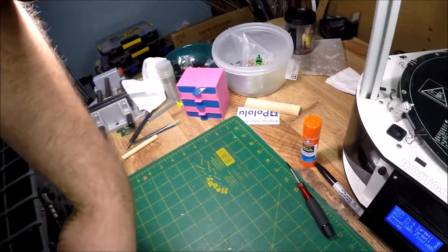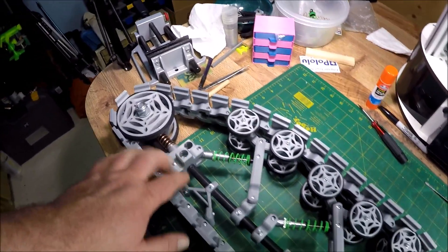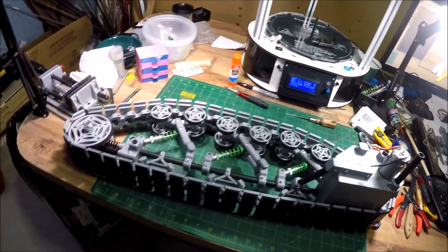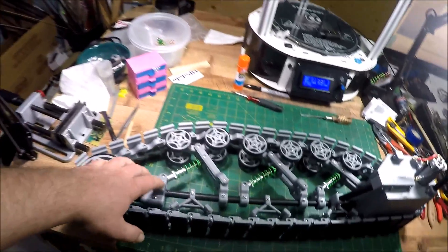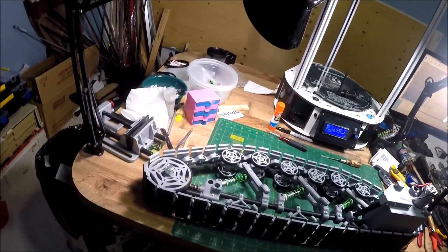A couple of things I still need to do — I can't do them until I've got the other track built. I've got two spars on the front here; these will connect the left and right tracks, with two spars in the back and two on the front. There's also going to be a diagonal that goes from here to here, and then a secondary frame spar from diagonal to diagonal. That gives me more mounting options — not so much for strength, though it does add stiffness — but really it gives me a place to mount all the pieces that will be inside the body.